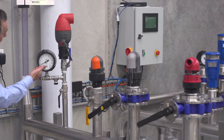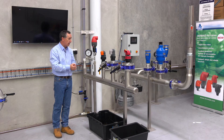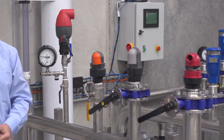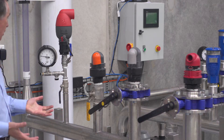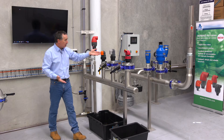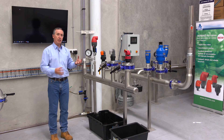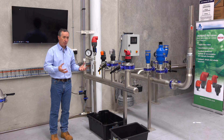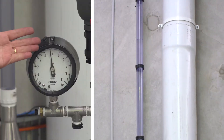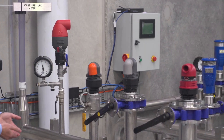You can see the gauge starting to rise and the level rising, and some of the valves are starting to have enough compression and buoyancy to make them seal against their seals. But as pressure continues to rise, many valves on the market still need up to five meters of water pressure to seal — and that's inefficient. We can see the pressure at two and a half getting close to three meters, and still some valves are almost closed, still leaking. It's not a fault with these products, it's just that the inherent design, the buoyancy, the float mechanism, the sealing arrangement just needs more water pressure. Now we're at four and a half getting close to five meters, and we can see that the Bermad valve has been drip-tight whereas many of the other valves continue to leak.